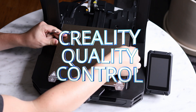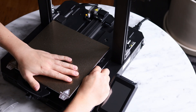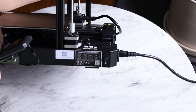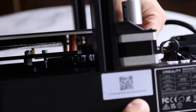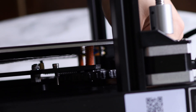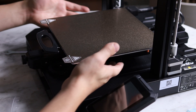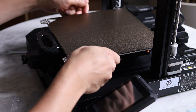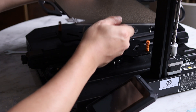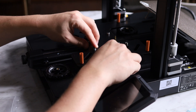This machine isn't quite ready to print right out of the box. The S1 has this nice low-profile design but it makes these eccentric nuts a little bit harder to reach. There's actually a bolt that's in the way here, which keeps me from getting access to that v-groove wheel from this angle. It's so tight that if you have really big hands you're not going to be able to get in there. So it might be necessary to unthread the bed leveling knobs all the way and take this top off so you can more easily get the wrench in and get the bed tension just right.